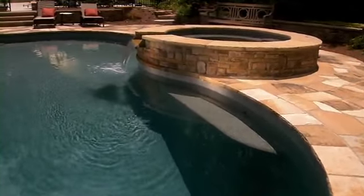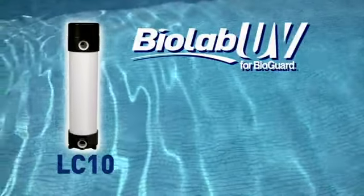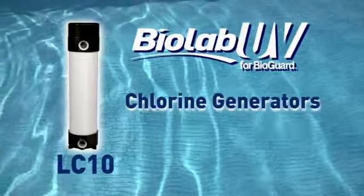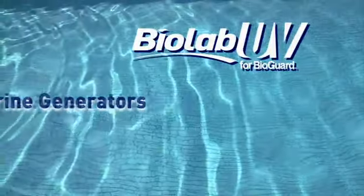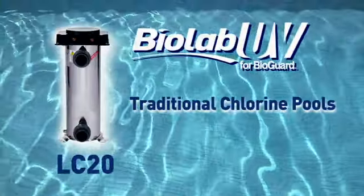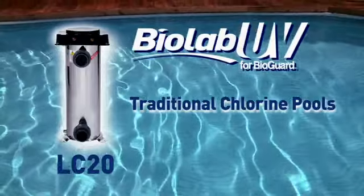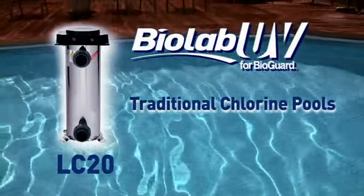BioLab offers two UV units. The LC10 unit is constructed of a PVC housing and is ideal for pools equipped with chlorine generators. The LC20 unit is constructed of high-quality stainless steel and should be installed on pools using traditional chlorine as the sanitizer. It is not compatible with a chlorine generator.